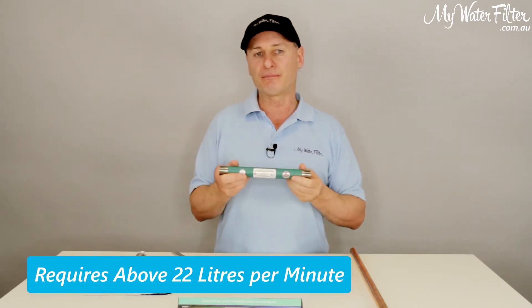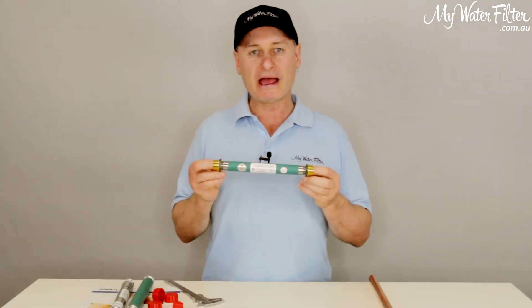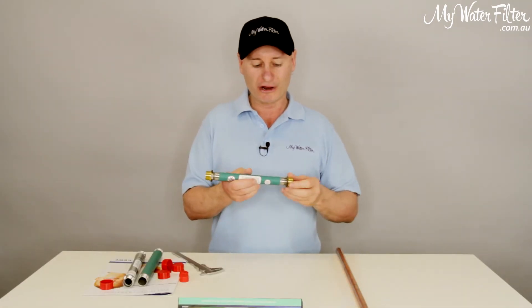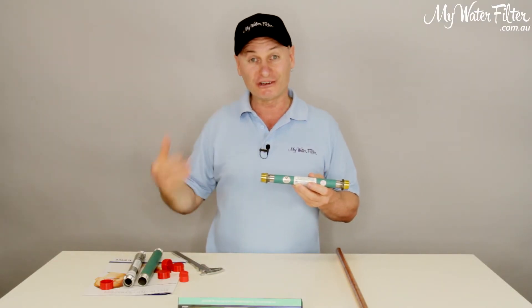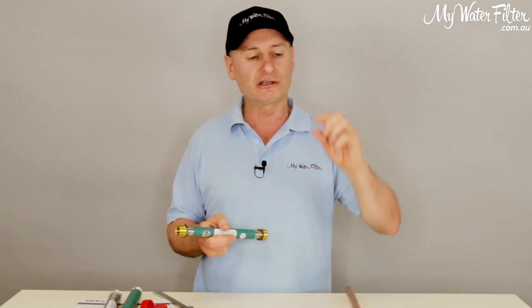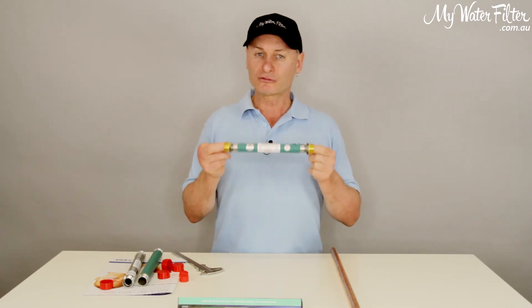So three-quarter if you've got a flow rate on a pump of 22-plus litres of water, but failing that, just take some confidence — we guarantee it. We back them: this good old half-inch Limetron, three-quarter-inch ends, one millimetre difference on the inside between our pipe and the Limetron, and water's not silly. We don't give water enough credit. The water gets pushed through by the water pressure, but there's tension in water — water will pull itself through a device as well. And by the time this water goes through the copper pipe to the house, it breaks down to half-inch. So throughout the house you haven't got pipe like this — you've got half-inch pipe, much smaller. And then the water's got to come out of a little washer. So when you crack a tap in the house for the shower, the sink, the dishwasher, whatever it might be, it's a tiny little gap that opens up between the washer, and the water finds its way through. So have some confidence in your water — water's an amazing product.